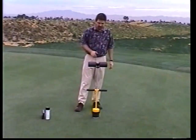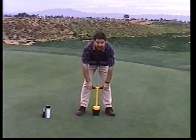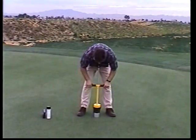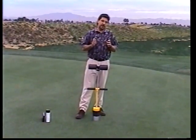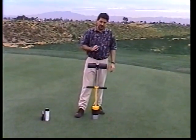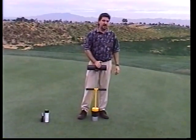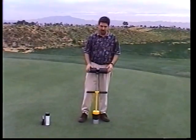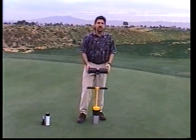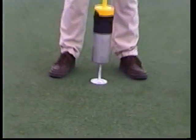For ejection, you simply put the blade back in the hole and engage your pins into the hooks on the blade. Pull the blade up a few inches at a time — that's going to leave a gap between the plug and the inside of the hole. This next feature is really unique among any hole cutters: I'm tamping the top of that plug with this tamper, expanding the plug back into the hole and fitting it perfectly. I go up about three more inches, tap it slightly, then pull it up. With the tamper, I can tap those seams and get a perfectly flush plug.